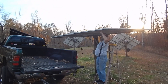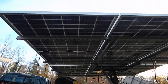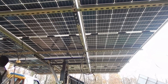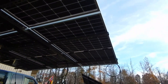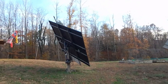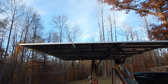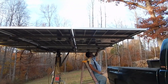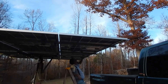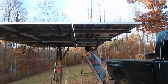End of a long day — those are the last few bolts going in. These were a bear. Everything's got a nice lineup, everything is perfect. We'll finish this off tomorrow. We have to come down here with the combiner box, change the charge controls around, get rid of a couple of breakers, and check actuator travel. I've got to run series wire connections into the breaker box. It's about 4:20 — we're getting done.